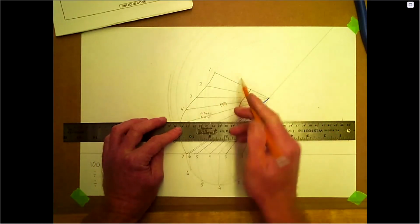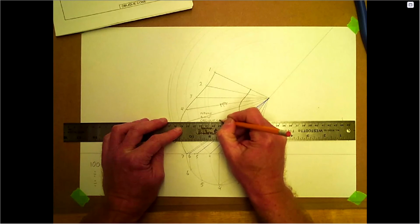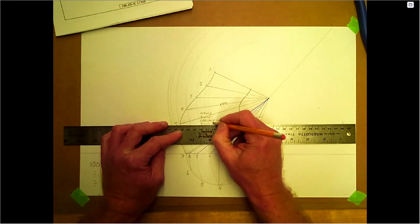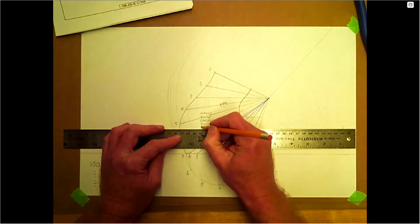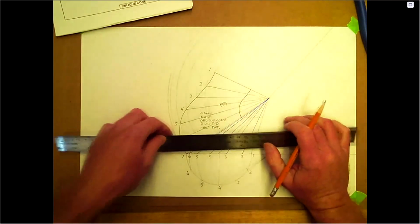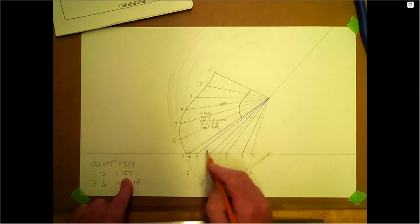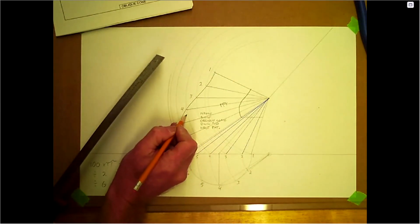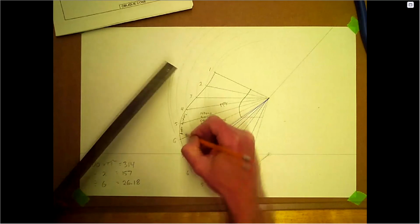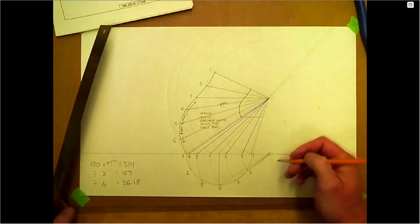This one here is the oblique cone. Number 10. This is a half pattern. Forming direction. So we would have, this is actually still on the bottom here, a 100. So form to 100 diameter. So you can still use a round pattern for that and check that as you're bending. That'll work just fine.